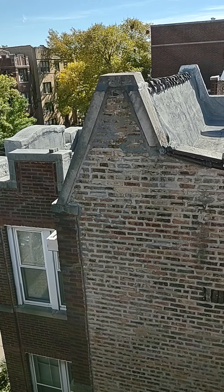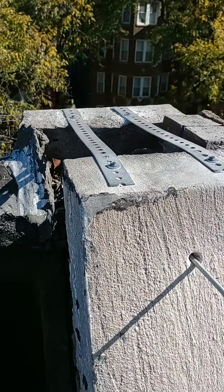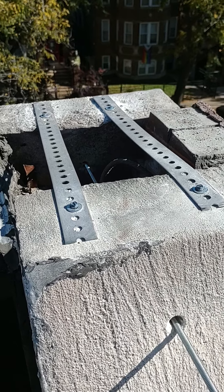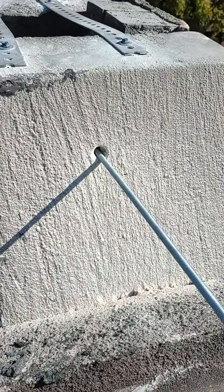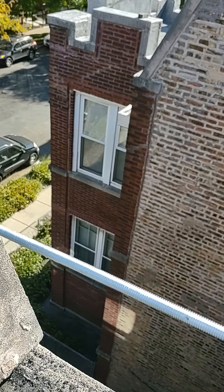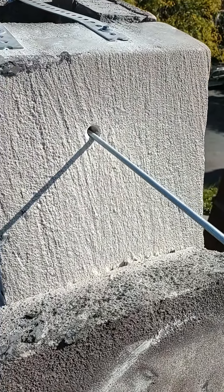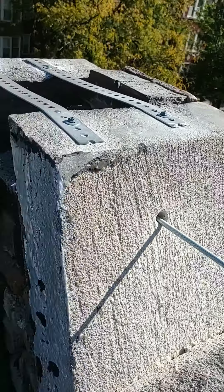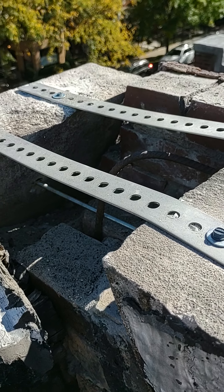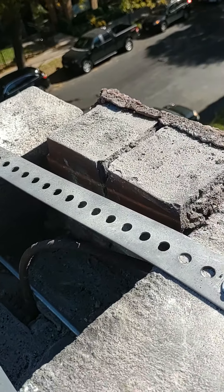This was a header joint just like on the neighbors — a couple stones up there. Unfortunately one of them came loose and it's crooked, so I put a couple straps on top with Tapcons as a temporary thing until I got the bolt in there. You can see I'm turning the screw right now — you want to put the screw on before you cut it, because then you mess up the thread. I put a little bit of rebar in and I'm going to basically pour concrete inside of that to give it some strength on top.